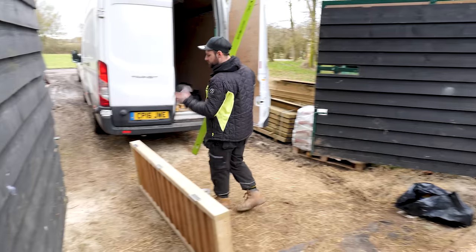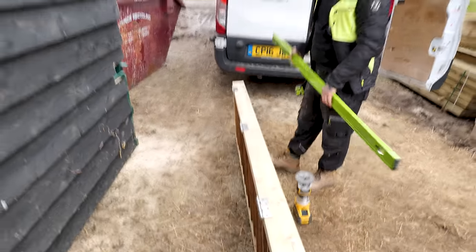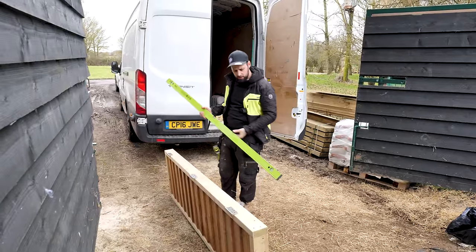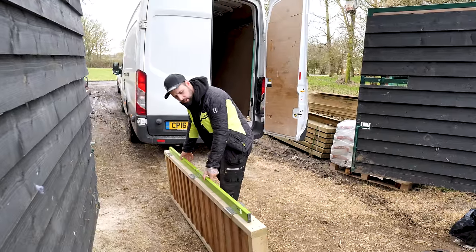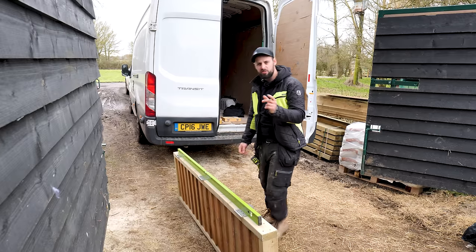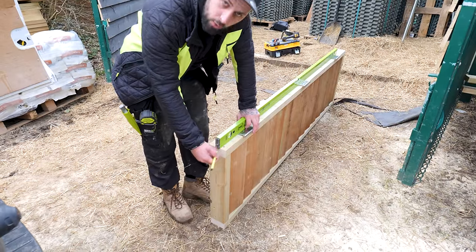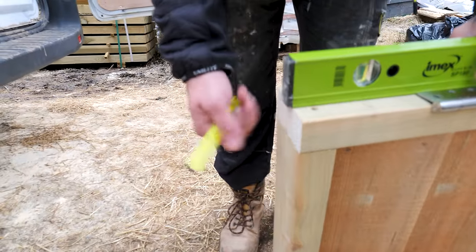That is our hinges installed on our gate or door. And our next job is to transfer the position of these over to our frame or opening. So a quick tip for something like this where it's outside. On the end of most levels, you've got a little bumper that's about 5 millimeters. And that's the sort of gap we want on something that's outside. It's going to get a lot of movement. We come to the top of the door, oversell the black bumper that's on the top. That's our 5 millimeter gap we're going to have on the top of our door.